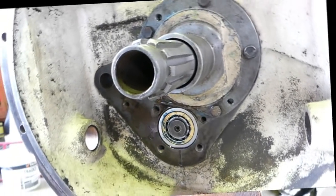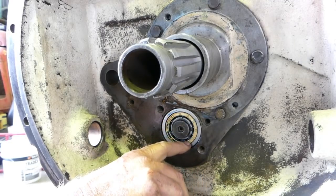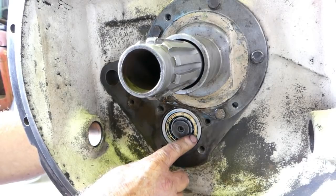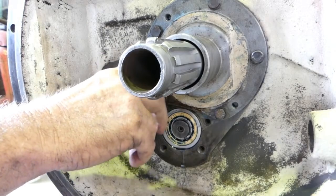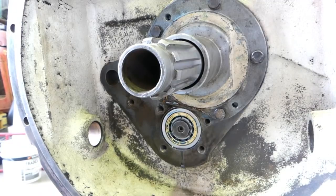Okay, we're around the front again, and this is the needle bearing on the lay shaft. Now the bearing at the back, as you recall, I've just put the circlip front and back of that, so the shaft can't move, but it does have a nice sturdy needle bearing here that supports the front of the shaft. Now this gets a lot of load sometimes because you have a driving gear up the front here and dropping down onto there, so actually out of the gearboxes we had to find the parts for these. We actually had a couple of bearings that were actually chewed right out.